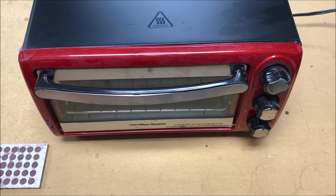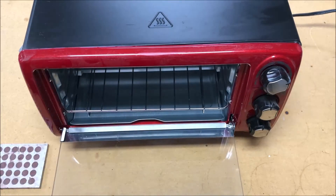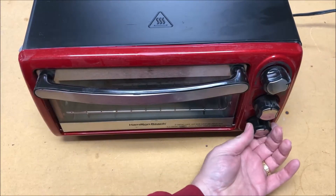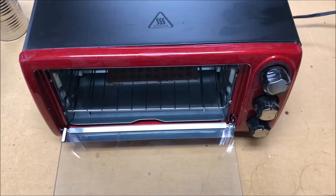This is the toaster oven I use for utility work like this — picked it up at a big box store. You might pick one up at a thrift store for less than 20 bucks. I also use it for powder coating modern ammunition, but it'll do the trick here. I've got the temperature set to 250 degrees, so we'll take our plug plate full of wet clay and put it in. I actually let these bake for about 40 minutes, not just 20.